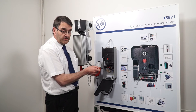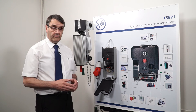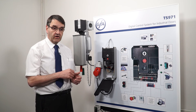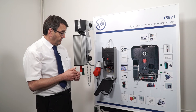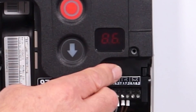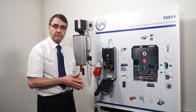Once that has been done, each time the door is operated the panel will count down. To determine what the panel does once the door has reached the number of cycles set on the cycle counter between services, you can set one of four options by going on to parameter 8.6. These options are all listed in the manual and you would need to refer to that to decide what course of action was to be taken.